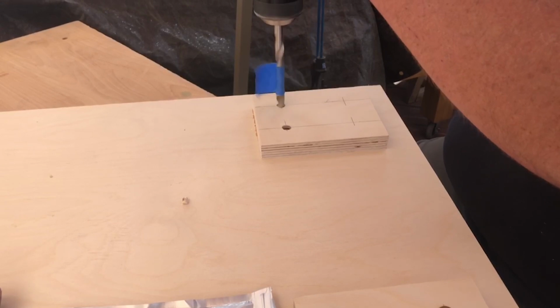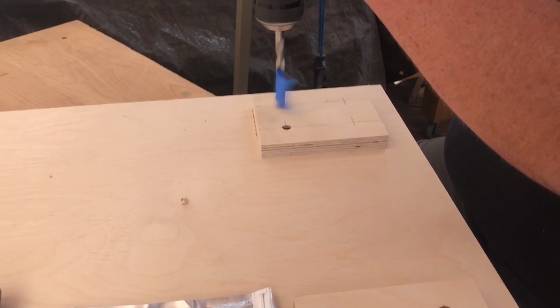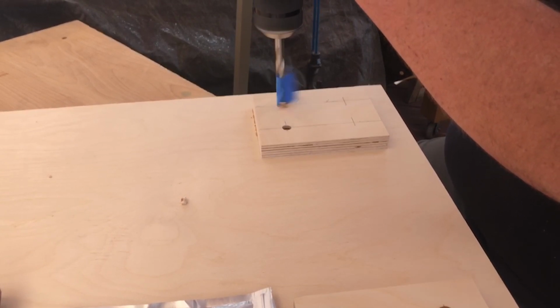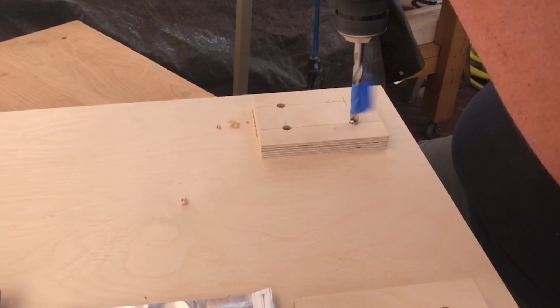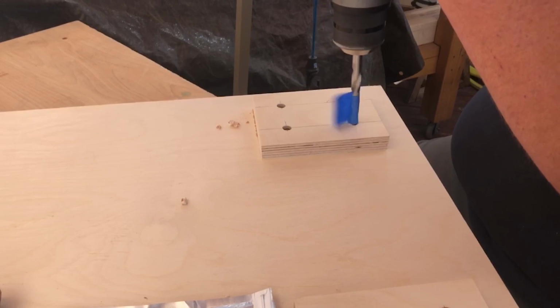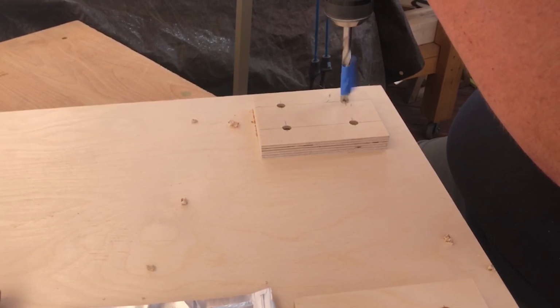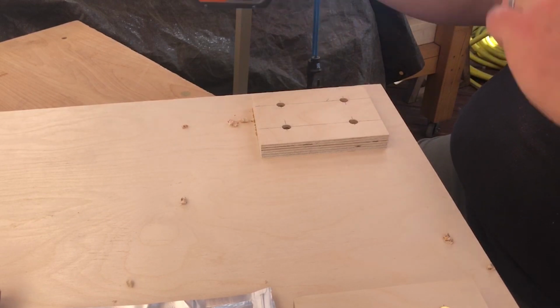Okay, so this thing is so heavy and so big, and she wanted to be mobile, plus I'm wanting to try and flat pack it and ship it, so I needed to put wheels on it, but I needed a way to put the wheels on to where they would be easy to install for a customer or for anybody for that matter. So in order to give it a little bit more strength and stability, I glued on an extra block where I want the wheels to go, and then I marked on that block where I needed the holes to go for the bolts.